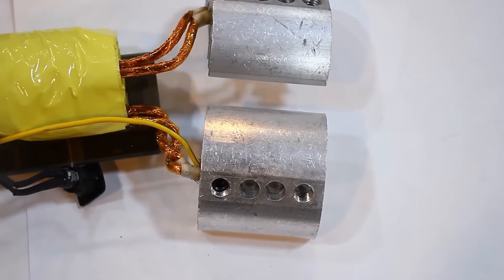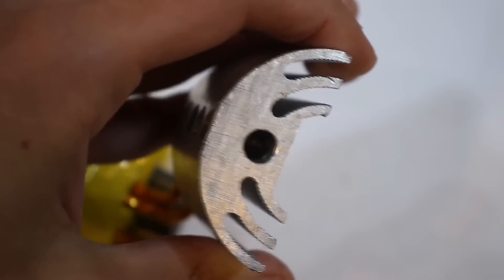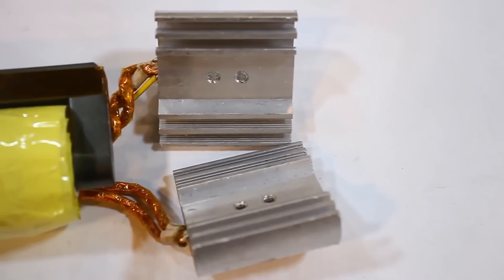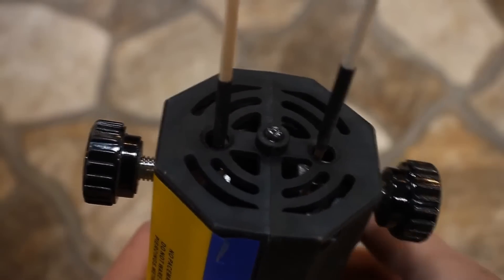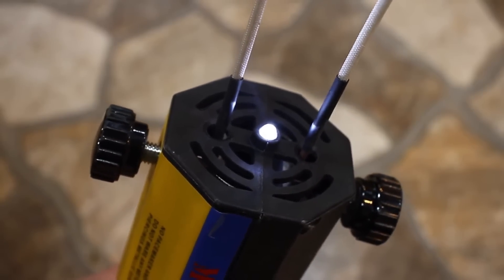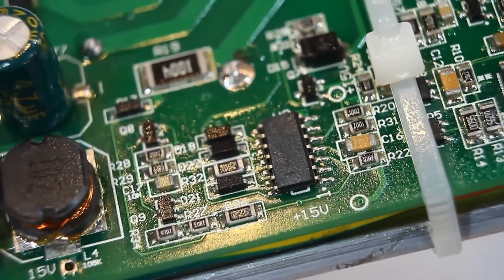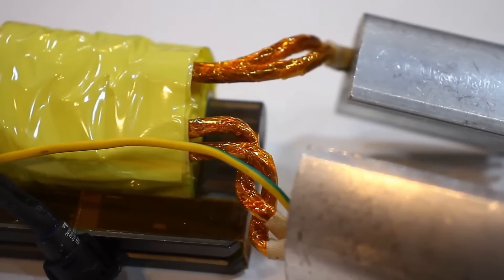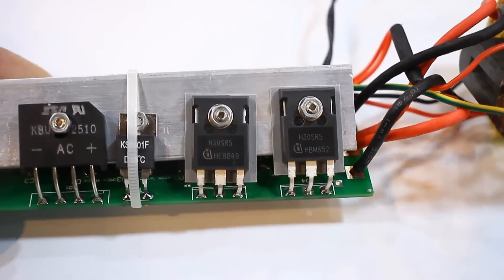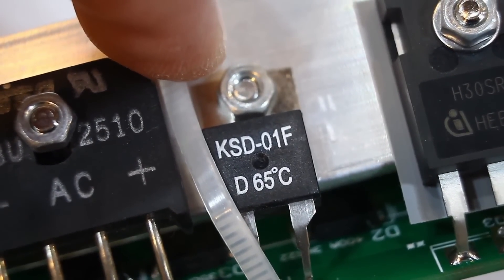The leads of the secondary winding are attached to two massive aluminum heat sinks, to which the inductor is in turn pressed. This is quite important because the inductor does not have water cooling and will heat up significantly during operation — the heat sinks help dissipate heat from the inductor. There is a front LED light active only when the device is operating. On the positive side, all wires are in silicone heat-resistant insulation, the board is coated with varnish, the transformer is wound with Litz wire to reduce the skin effect, and almost all power components have a margin. It's also pleasing to see the presence of a thermal relay at 65 degrees.